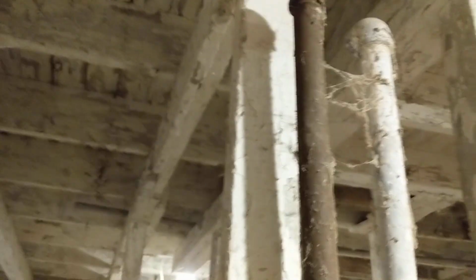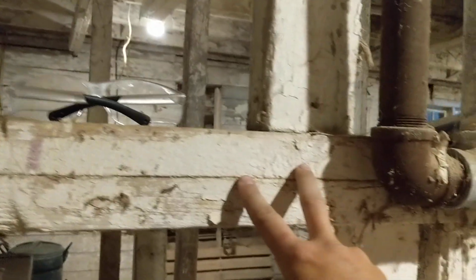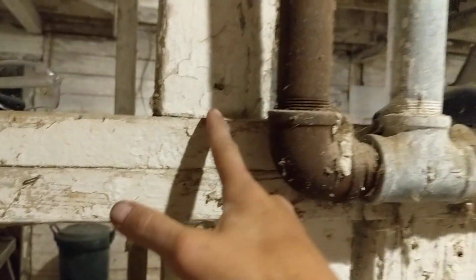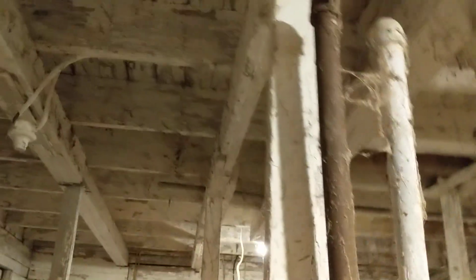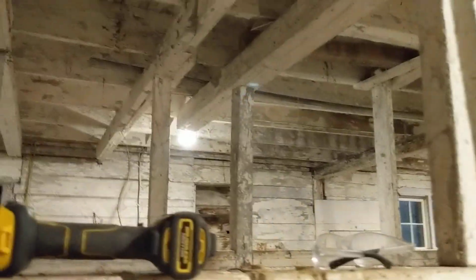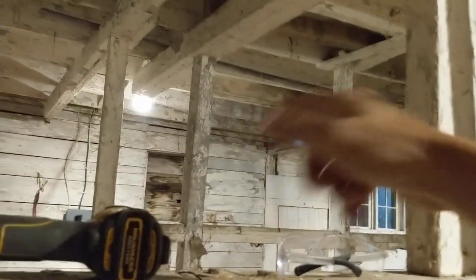This is currently pretty janky. It's a 2x4 supporting that. And then it's toenailed to this double plate 2x4. And then not even directly in line with it is another 2x4. So I don't think engineering had anything to do with that. That was just totally hobbled together, and it's pretty dumb. So we're going to remedy that with a simple 4x4 coming from the beam up there down to the floor. So that'll be two 6x6s, two, if I can talk right, two 4x4s.